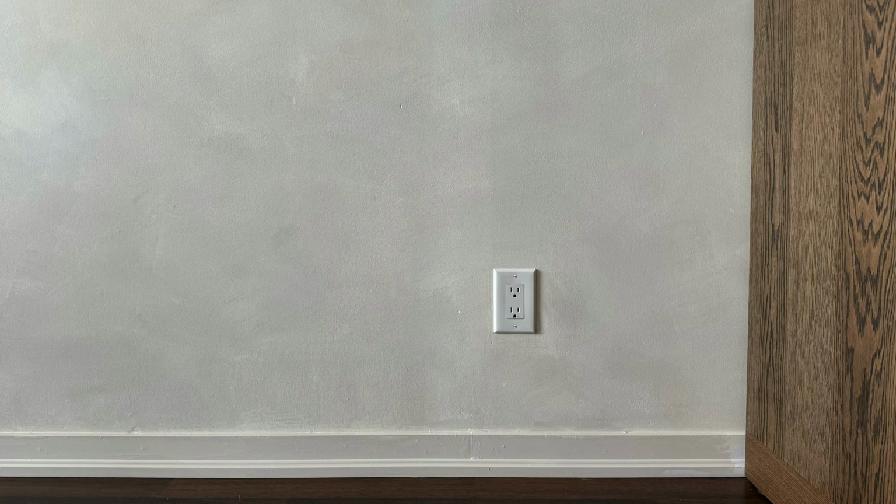because when you mix the lighter and darker color together to get the lime wash, the overall effect is in between the light and the dark, but it's still closer, I would say, to the darker color than to the lighter color. So if you paint the baseboard the lighter color, you are going to visually notice it a lot more than if you paint it the darker color.